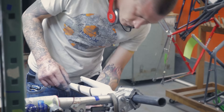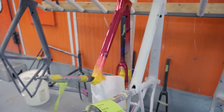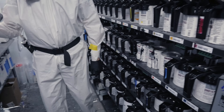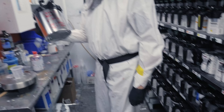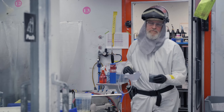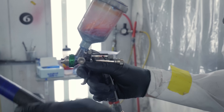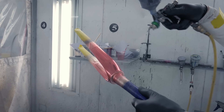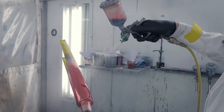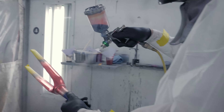When it comes to paint, the color palette is essentially infinite. In the print world you have cyan, magenta, yellow, and black — four base colors. In the paint world, there are 64 separate toners that we use to start from. There are dyes, pearls, different levels of gloss, metallics, iridescence, and flop — a much broader palette to work from. It's important to apply this color very evenly and not too much, because you can't back up from too much color.